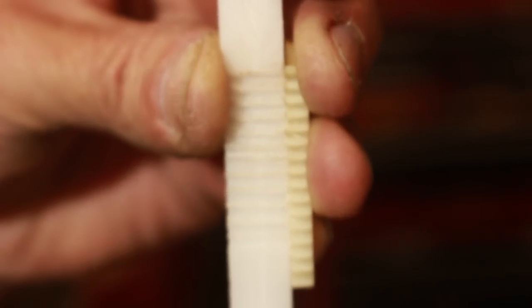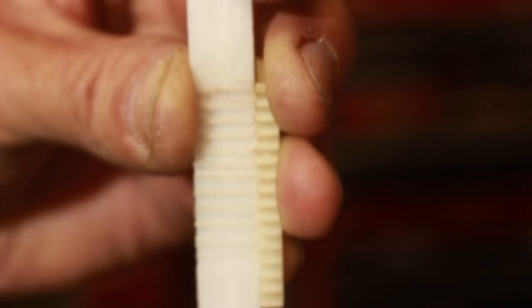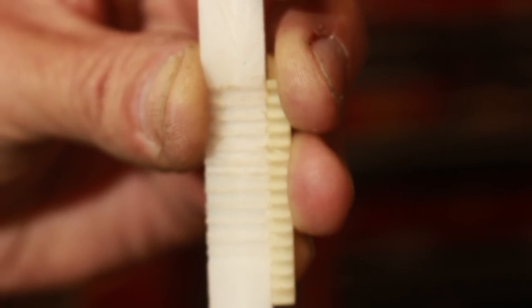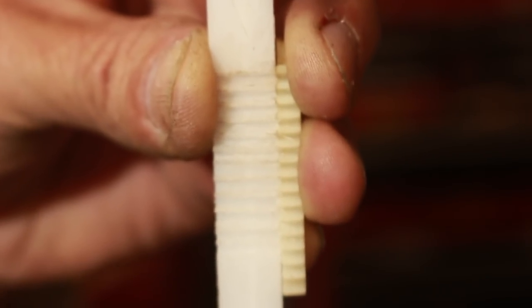Switching to that larger file was a mistake because the moment I did that, my tooth alignment got wider — the base of that file is not an actual knife edge. I'm going to have to start over.